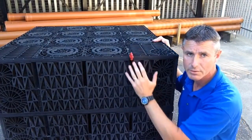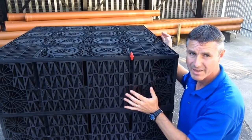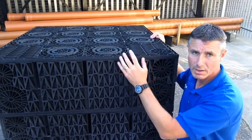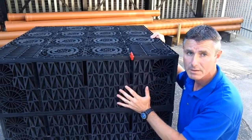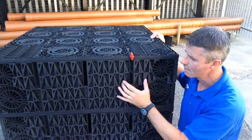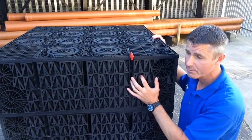The crates themselves are held together with clips — just a double clip — and it pops on like that, and the next one sits on top. That clip sits in the hole of the next crate and holds them together. They're not structurally doing anything other than holding it in place whilst you backfill, because it is the backfill around the excavation that actually gives it structural stability.